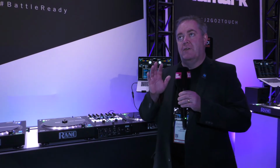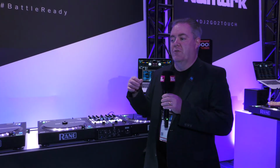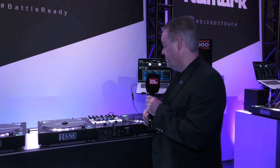The way that you decide to structure this mixer is how you're going to be able to use the mixer. You'll notice that we still have the aluminum toggles in the middle of this. That is very solid construction. You can rotate those. So if you're looking to do an echo out, and you want the effect to be locked in when you bring your hand down, you bring your hand down, lock the toggle in place, and then take the fader out, and then you have your echo tailing out in that situation.